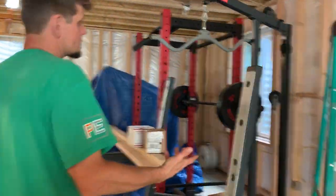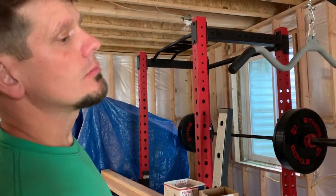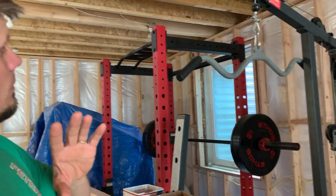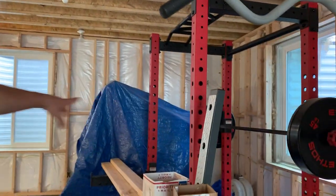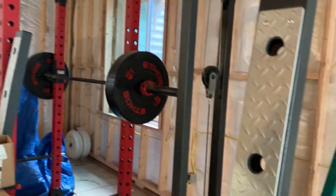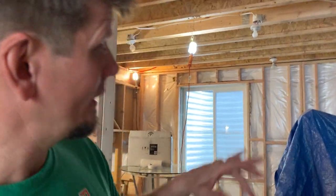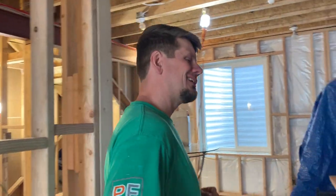In here, this is going to be an exercise room — this is a great job to show you. They wanted some extras put in. We're going to have all of those outlets in the wall in yellow — 12-gauge, 20-amp, AFCI. Why? Because she's got a NordicTrack, she jogs, and they're going to put in a treadmill and free weights. I did do a backup circuit in case they get another piece of equipment.